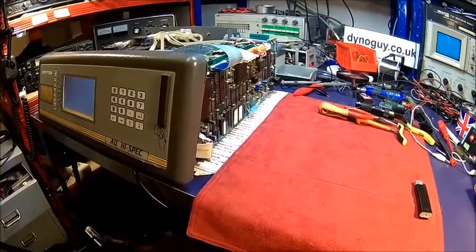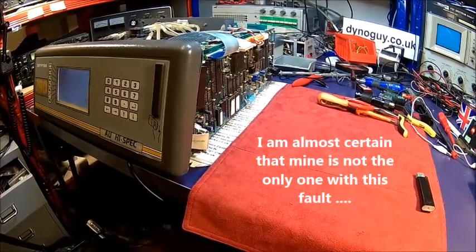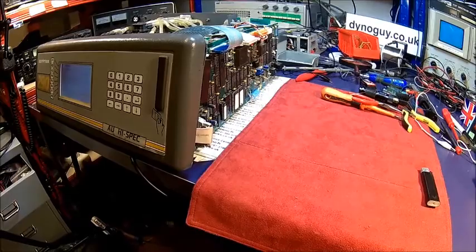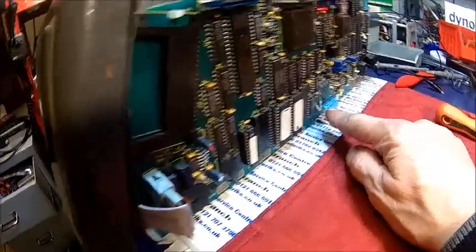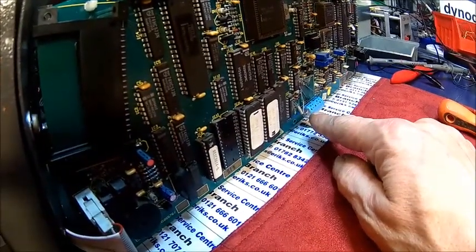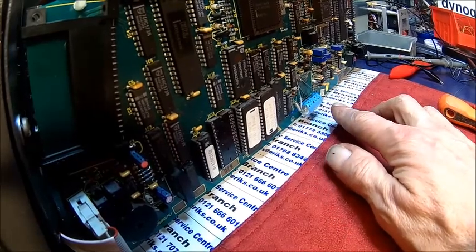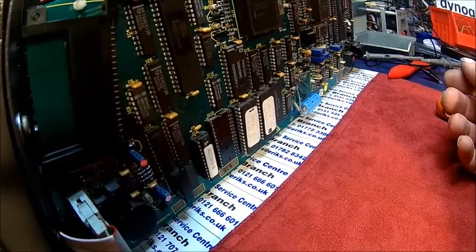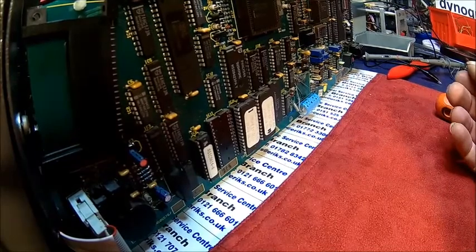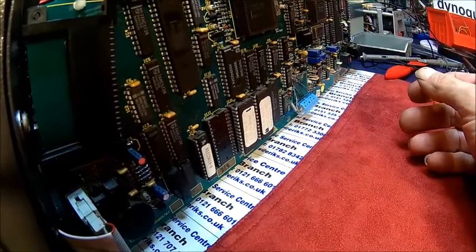Maybe this whole journey is useful for someone else. We still need to find a replacement battery, because that fault is probably a common one. The main problem was the battery lost its electrolyte — everything drained down and was eating away at the tracks, three in total. The capacitors were changed; they might have been okay, but if you're taking them out you might as well put new ones in.